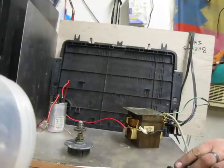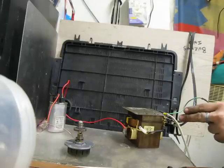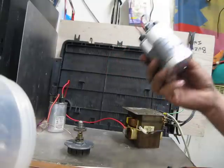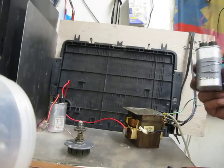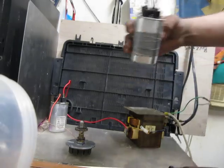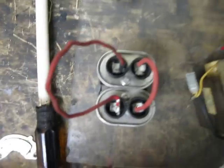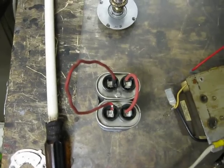Now this is where we're going to go into resonance. If you want to learn a lot about electrical engineering you can go off to Wikipedia, but basically it boils down to: for every single transformer you use, you need to use two capacitors. Ideally all of them are at the exact same rating - both of these happen to be one microfarad. The one currently hooked up is 0.94, I believe, so not much difference between the two. What you want to do is run them in parallel - same side connected to same side. That way the circuit treats it as just one capacitor with a two microfarad rating. But magic happens when you do that.